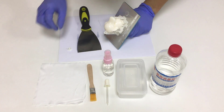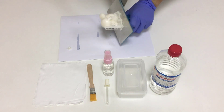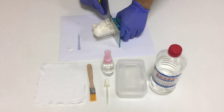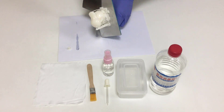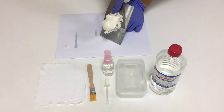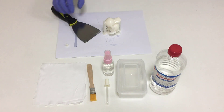Now let's try to pry the print. Here we use the rigid resin, so the rafts are very fragile. We need to be more patient. The skill to remove the objects from the build plate is finding the acting point around the rafts, where we can pry apart the prints with a metal scraper. Once a crack between the rafts and build plate appears, slowly continue to push the metal scraper into this crack, and then the removal becomes quite easy. Then set them aside.